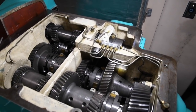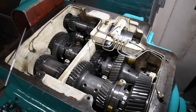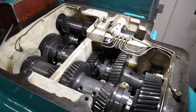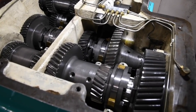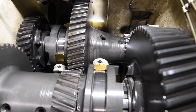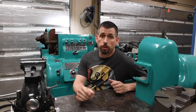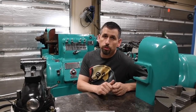That's kind of what the headstock looks like — a big, giant, heavy assembly. The fact that in a few hours I was able to wear out that brass isn't terribly surprising when they were in the wrong position and not being lubricated. These shoes are used universally inside the headstock — that's how all of the gear-change movement happens. So that's what I wanted to show you guys and see if anybody had any input.